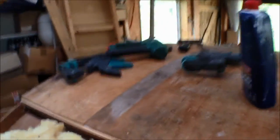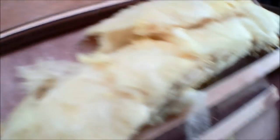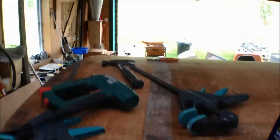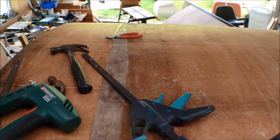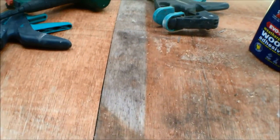The curve isn't great so I'm just going to kind of go up to here. You can see this is where the join is. In hindsight I should have matched up that join with this join, because I had these extra bits of timber to level things off. As it turns out, because these flow in the same direction, there isn't a need. If you look at the reflection further down where those pliers are, it's actually not in bad shape. So I'm going to put wood filler between the two — there's probably less than an eighth of an inch between them — and then I'll sand that smooth.